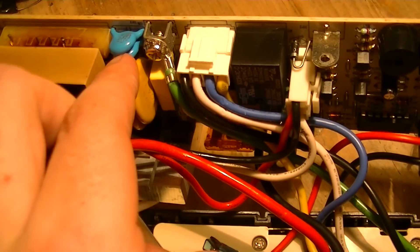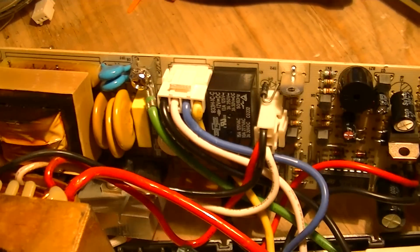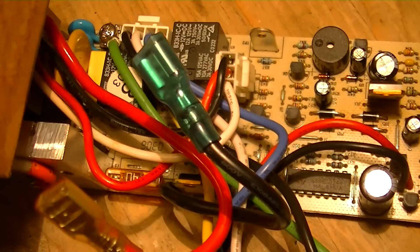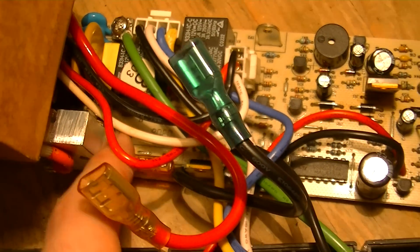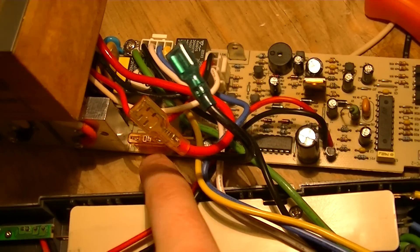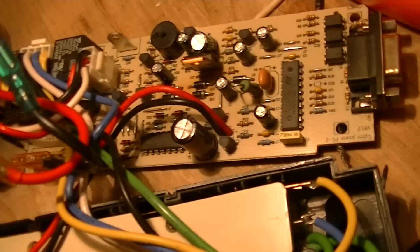Some capacitors — those are for QRM suppression and such. There's a 40-ampere ATC fuse for master overcurrent protection. There's also a date code on the board: week 3 of 2000, or week 6 of 2003. There's also space for a second fuse, because for bigger versions of this product they probably have another fuse — sometimes a pair of 20-ampere fuses instead of a single 40-ampere one — so the board is set up to use whatever configuration they need.